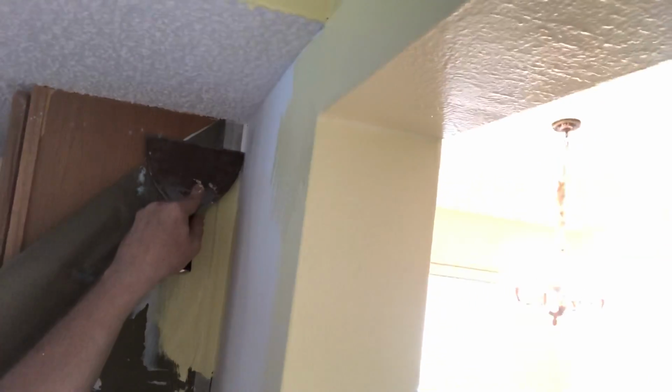And what I did while I was off camera was I took very dense caulking and I put it in the gap and I put a lot of it in there. And so you can see it right there, right? And because the gap was so wide, I used a 6-inch taping knife. You see the corner on this? See that corner? If you do it with the wrong one, you're going to put the caulking in and then pull it out if you use the wrong one. So just look at how the taping knife served the purpose. You see how it flattened it out?